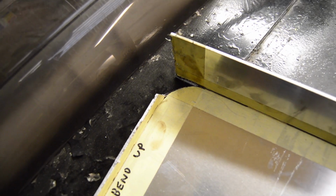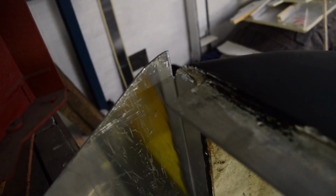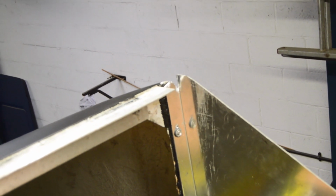Now I needed to bend around the 2 ends of the folded flap so that it matched the pod. I also did the same things with the front of the flares, so that when the back panel goes in and locks down following the shape of the pod, the 2 tabs can be sealed and hammered over, locking it all in place.